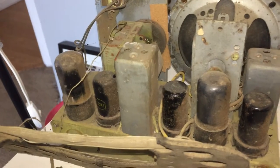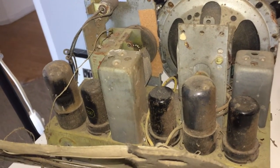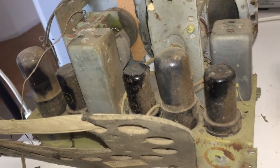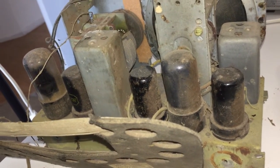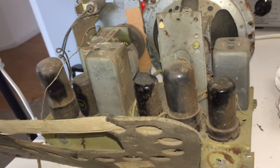These things will kill you without mercy, especially if you have them wired backwards and you have the hot lead going to the chassis. Even when the radio is powered off, the chassis is still hot — and with the off switch, you could touch the chassis and touch ground and kill yourself when the radio is not even powered on.